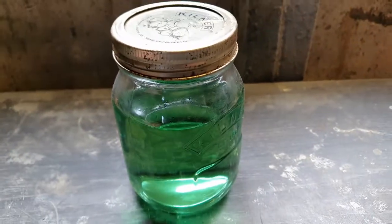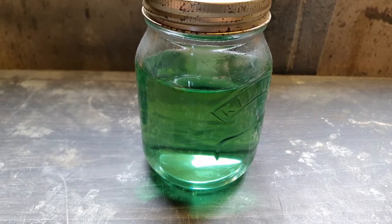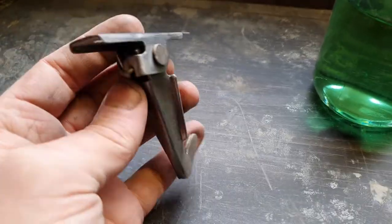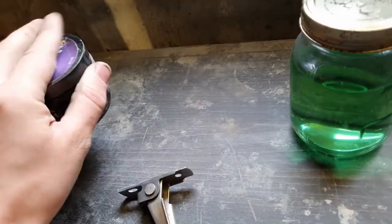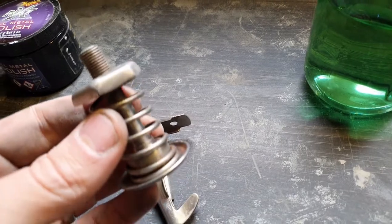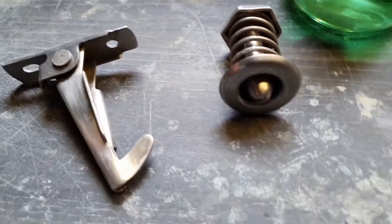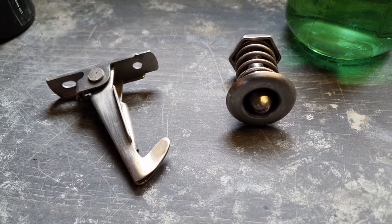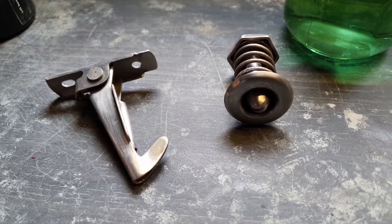Once you've finished plating, don't forget to jar this back up — you can keep it indefinitely, it'll just get darker in colour as the nickel content increases. Overall, very happy with the finish, it looks good. I've given it a quick polish with this stuff. Don't use anything like Autosol, which will cut into the surface and end up taking off the nickel you've just put on. This thing's come up pretty well. I've done this as a test and I don't know what the longevity of it is, and there are a lot of good kits out there which I'm not rubbishing — they're all very good.